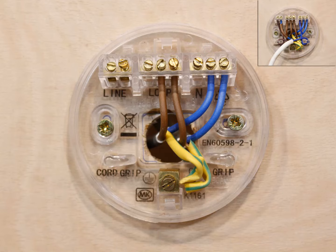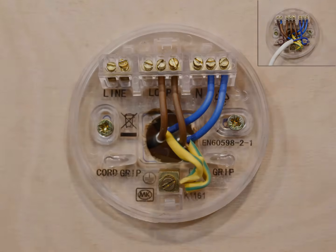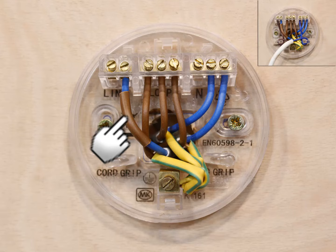How would you identify the wires that belong to the main lighting circuit? One way is to trace back the live wires to the main grey insulation, find the corresponding blues and check that they are connected to the neutral block. You can see two cables each with their appropriate wires connected to the loop, neutral and earth connectors. Now it's time to add the switch wires. Connect the brown wire of the switch to the loop connector — the other end at the switch will be connected to the common connector in the switch. The blue wire at the switch is connected to its L1 or L2 connectors and these will be connected to the line connector of the ceiling rose. It may seem confusing why a blue wire is essentially used as a switch live, which is why electricians add a brown sleeve to differentiate it from a normal neutral wire. This happens simply because the same type of wire is used to connect a switch as used in the main lighting circuit.